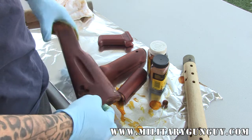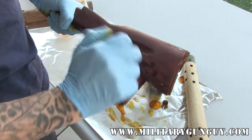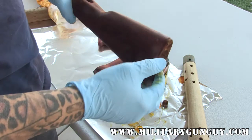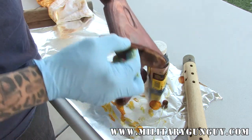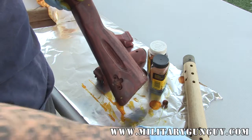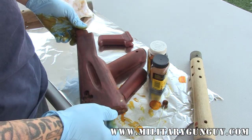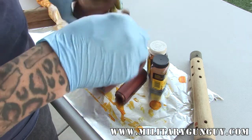The problem with some woods is that you'll end up seeing where some of the end grain is, you'll see these little black splotches. It looks terrible. Sometimes the only way to fix that is to remove the stain coat a little bit, and then come back and seal it with bone, basically. And I'll show you how to bone wood here in a second. And then reapply the stains, and that will generally do the trick.